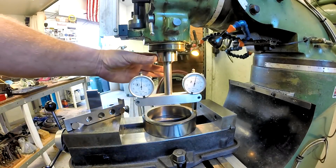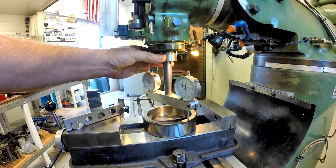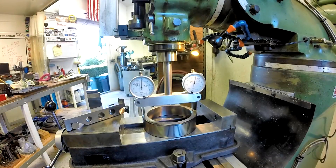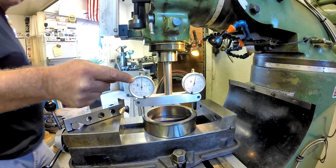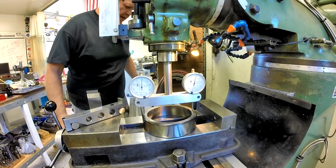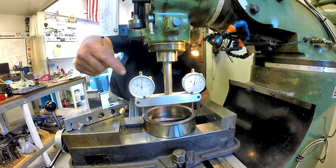This was built for me by Mr. Rick Gearhart. I've got the head in neutral and I'm just using a bearing race to swing this thing around and check tram. There are a few things you need to know — you need to make sure that your head trams properly with the knee locked. Notice this gauge right here, you can see it's a little bit below.